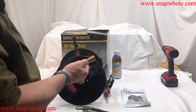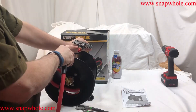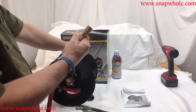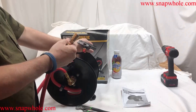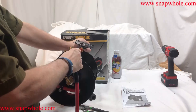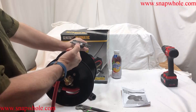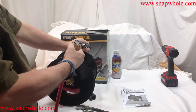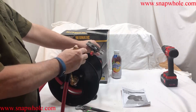I'll have to pick up some more of the red industrial ends. Harbor Freight uses a color code — red for industrial, blue for automotive. Brass you kind of assume is automotive, and steel you kind of assume is automotive unless it's labeled industrial. The reason industrial is a little better is it has more bearings to hold in the hoses, so you get a little less leakage, and it's made to a slightly better tolerance. I think they're worth it.